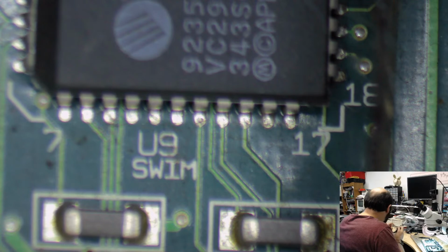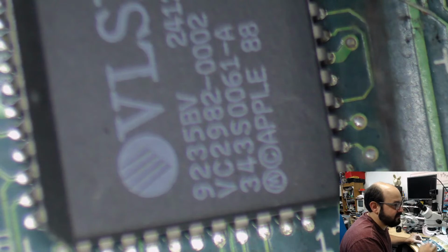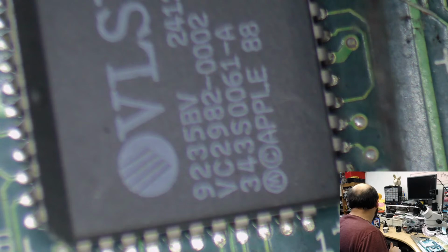All right, so I'm just getting some solder here to prime the iron. I'm not going to use the iron just yet. I am going to use this heat gun to get a bunch of these components off. So, no worries, Adam. Take your time. We're going to be here for a while. All right, so I'm going to turn the heat gun on. You're going to probably hear a lot of noise, so apologies. And we're going to try and get some of these capacitors off.